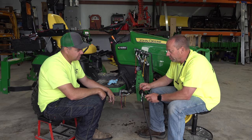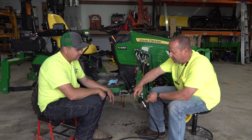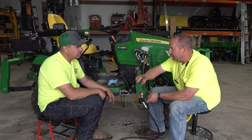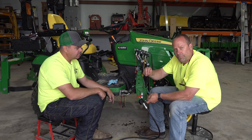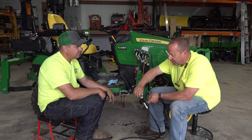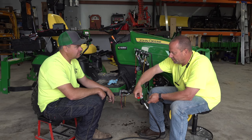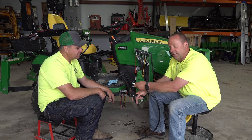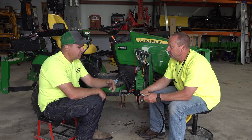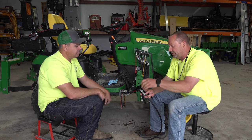And then what we're gonna do, we're not gonna watch it because we don't wanna do that. We're gonna turn this, and you will feel and often hear the pressure release. It'll be a little spurt of fluid that'll pop out of there. And just doing that once, you turn that, you don't need to crank this down. You just do that once and take this off, and it'll plug right in. It's amazing how little fluid oftentimes comes out of it. It's not much pressure. It's just a drop, but it seems like a lot the way it spurts out of there.